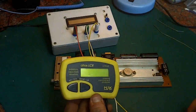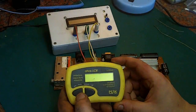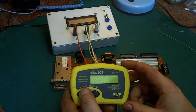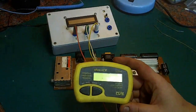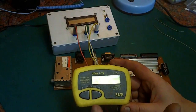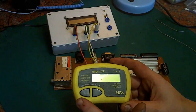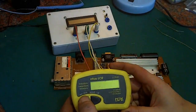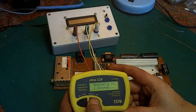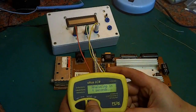Unfortunately, the battery failed on my camera just at the end of that video, so you didn't see me putting the LCR back together. I had a little issue — the new button I fitted was a little bit proud of the other button, so when I put the case on it switched itself on. What I had to do was heat the top of the button with a soldering iron, melt it down a little, and file off that melted plastic to lower it by about a millimeter and a half. Once I'd done that, as you can see, it now works fine.